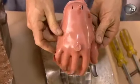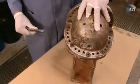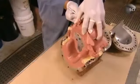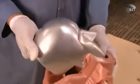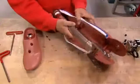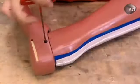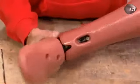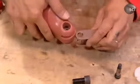Then a technician visually inspects the components to ensure an accurate fit. This is no ordinary vinyl. It's specially designed to resemble human flesh in consistency and density. This gives researchers realistic crash data. Now they install the bones, starting with this tibia, into their respective vinyl compartments. Zippers allow the engineers to remove the components easily after performing a crash test.